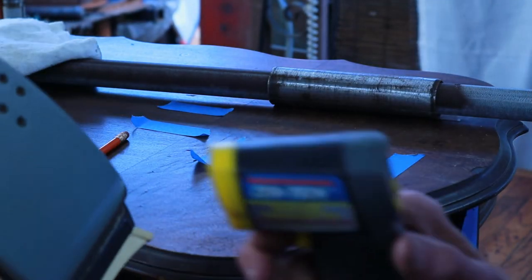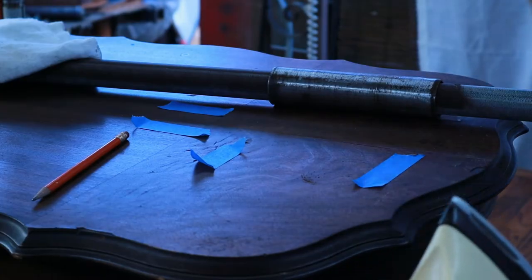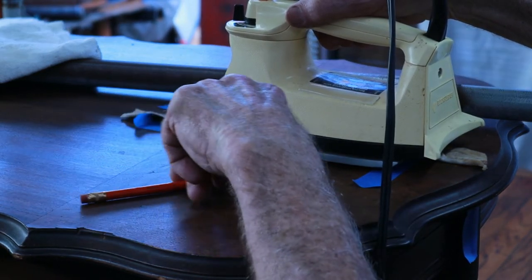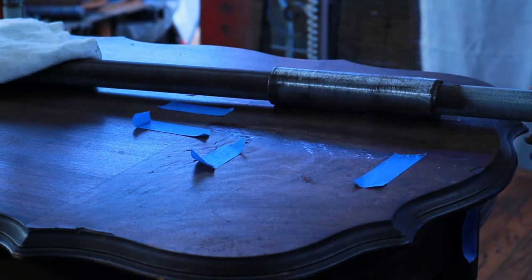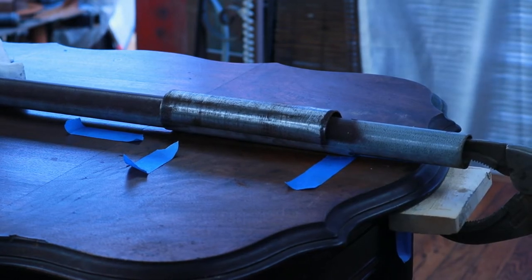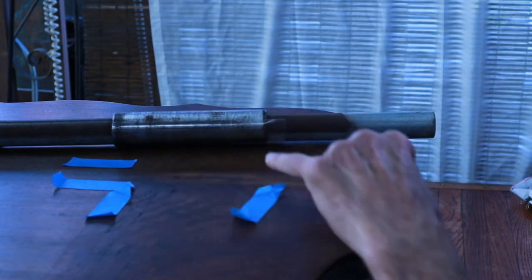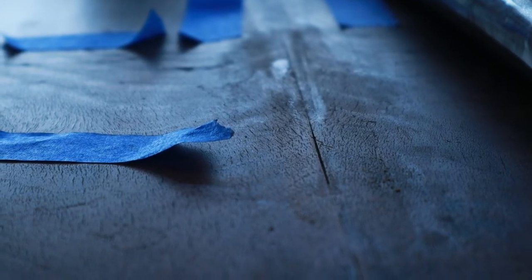What I'm doing here is I've got an iron at about 290 degrees. Old glue melts at about 150 degrees and wood burns at 500 degrees, so I'm going to be careful — try not to rest the iron directly on the wood, but keep it on a wet strip. Then I'm using a piece of pipe to put pressure just on the seam and not anywhere around it — I want to push just the seam down. And that worked out pretty well; it's nice and flat now. There's a little bit of separation, but that's something for wood filler — mainly I'm concerned about getting that peak back down level with the rest of the table surface.